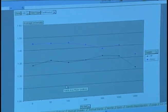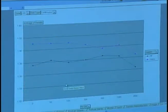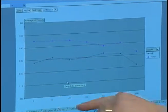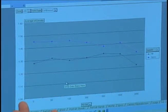All right. On the left-hand side here, this is density. In this case, higher is better. Higher is darker. The higher the density, the darker the image, and darkness is good. That's right. On the bottom here, this is representing the life of the cartridge. So here at the left is beginning at time 0. Over to the right is later in life of the cartridge. Right, because as you told us, you really measure the print quality from the very beginning when the cartridge is brand new all the way through to basically when it's at or just before end of life.